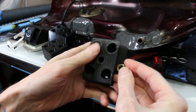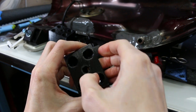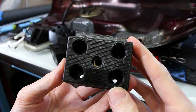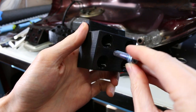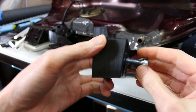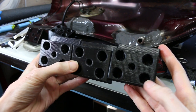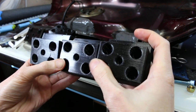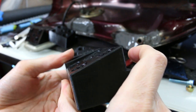My first print prototype was a bit too tight for a lot of the tolerances — I should have compensated for that. The nut barely fits in there. With further designs I made the tolerances a bit more generous. Thankfully I was very close, but your first print is probably not going to be perfect if you're doing a functional part. I did get it to where it works for the application I wanted. This is the fifth block I've made and I really only need two of them.